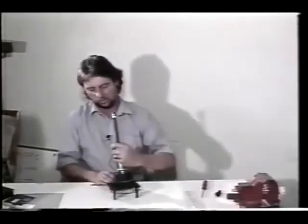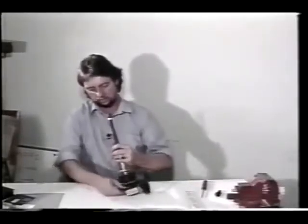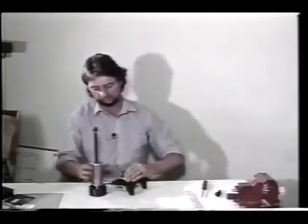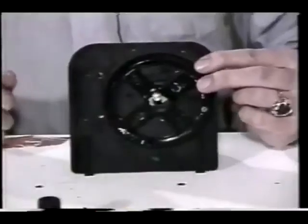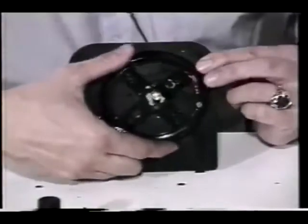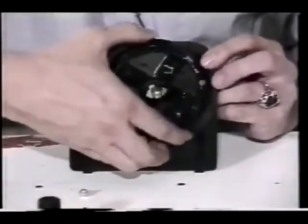This removes the dial quite cleanly and does not affect relocking devices, which is important if we want to open the safe after we yank the dial off. So remove the dial, and then we've already removed this one by slamming it. Leaves you a nice clean spline, and you're ready for the next step. The next thing we do after pulling the dial is remove the dial ring, this piece right here, which is held on with two small screws, very easy to remove.